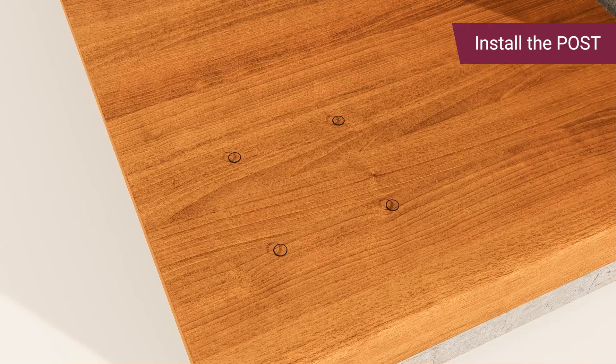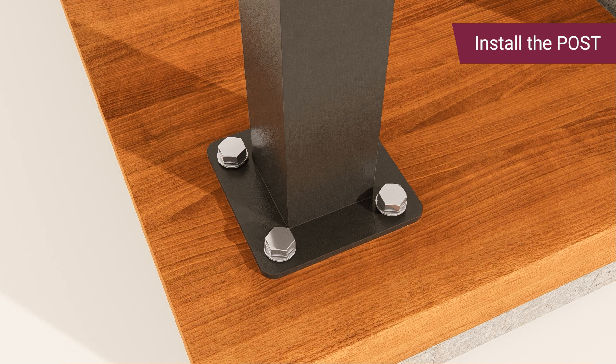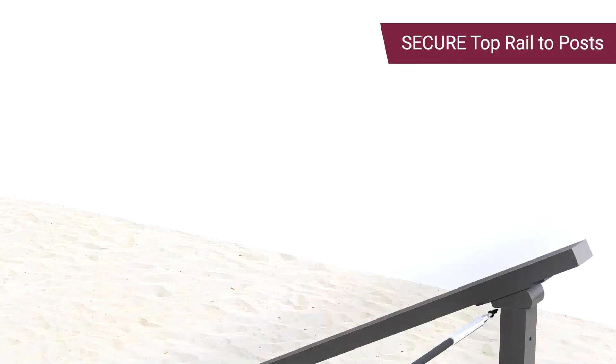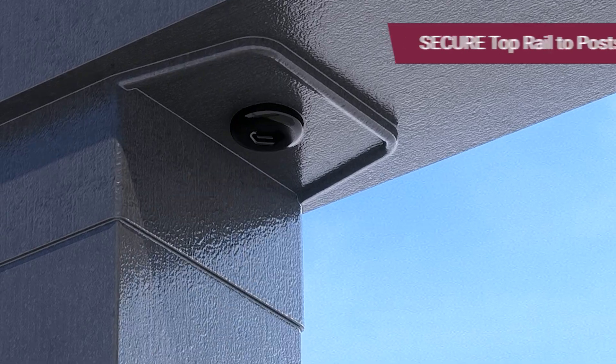For wood, use the small drill bit to drill the holes. Then align the post above the pre-drilled holes and install the washers and lag screws. Insert the metal post covers into the posts by sliding them in. Then use the self-drilling screws to secure the brackets to the posts. Finally, secure the top rail onto the brackets.